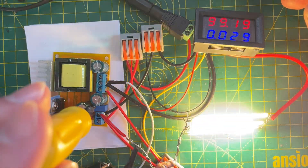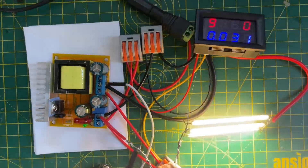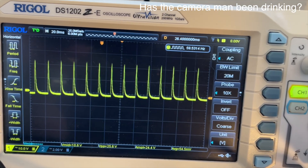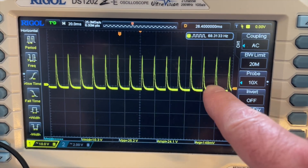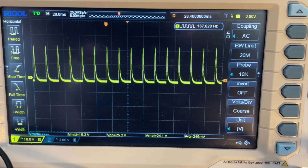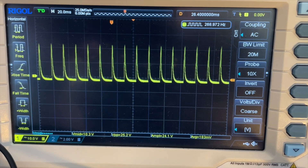The camera is definitely picking it up. If I switch over to the oscilloscope, you can see the problem quite clearly. We're currently on 10 volts per division, so that's about 22 or 23 volts of ripple. Not ideal — and that's why we're seeing this flashing.